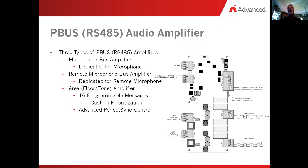And if we use a common message set in every single amplifier, they will be activating at the same time, sounding as if it's a bulk amplifier, one source, all the amplifiers regenerating, when in fact that's not the case. Each of the amplifiers is generating its own tone at its own location, and a single fail will be just an amplifier that fails.